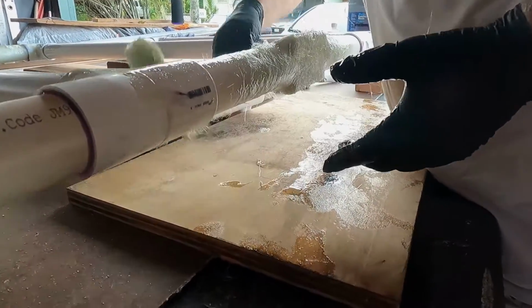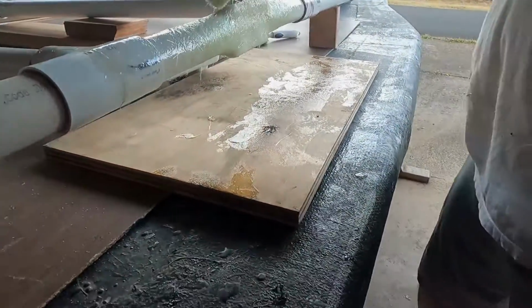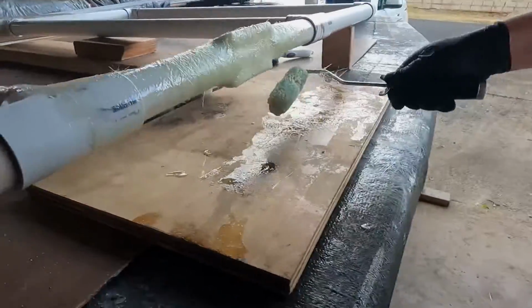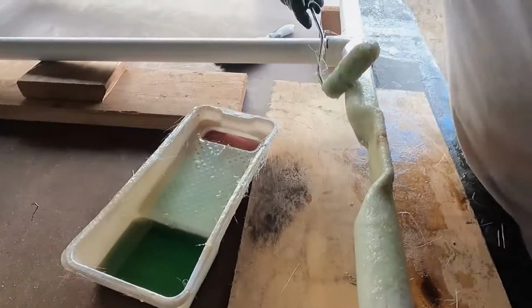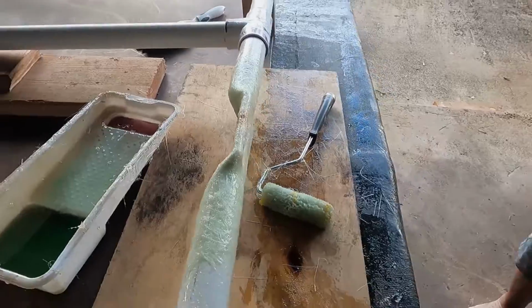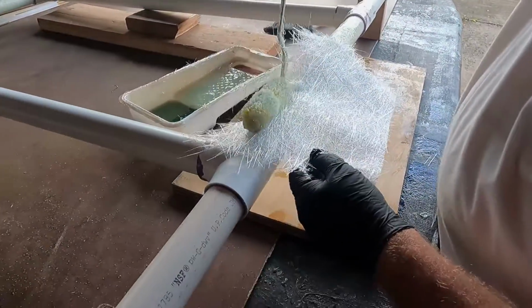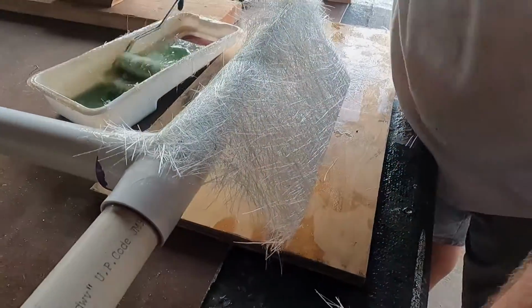Over and under with the material, really important to make sure that you're going to get some fiberglass on all sides here. The point is to reinforce this joint. So just like when you use foam to make a fiberglass sandwich for doing boat building, in this case, the PVC pipe is the interior of our sandwich. So by layering it with fiberglass, it's kind of like 1 + 1 = 3. You're creating a really strong material, and yet it's still going to be lightweight and relatively inexpensive.